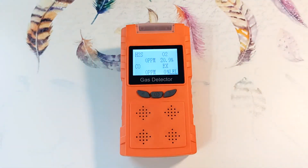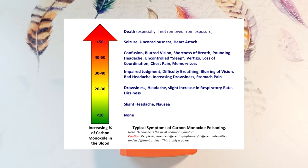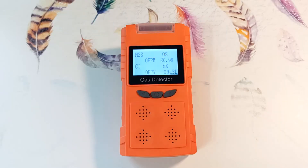CO is carbon monoxide. It is colorless and odorless, and usually forms if gas equipment has poor draft, or the damper of the stovepipe is closed before the coals burn out. If symptoms of carbon monoxide poisoning appear — weakness, drowsiness, rapid heartbeat — you must immediately leave the room for air. If this is not done, death from suffocation is possible. In the house, you should open the window and ventilate the room. The device measures the gas concentration in ppm and an alarm is triggered at 50 ppm.